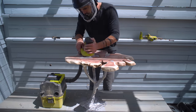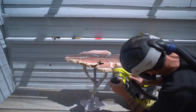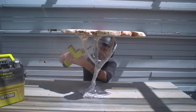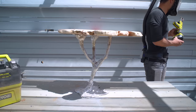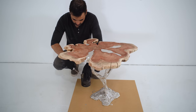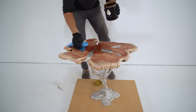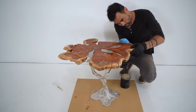This wood was quite hard and sanding on the end grain is always kind of a pain, but I smoothed it out up to a 220-grit finish. This little belt sander came in handy for getting into the nooks around the branches, and once I had everything looking the way I wanted I coated the whole thing with some Maker Brand Simple Finish — it's an oil and wax finish that works both on metal and wood, so perfect for this kind of sculpture-slash-furniture piece.